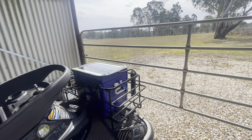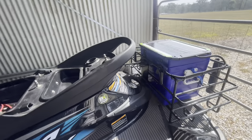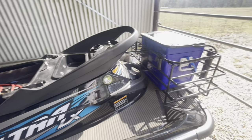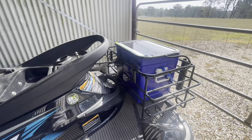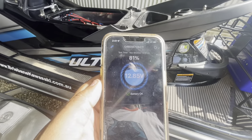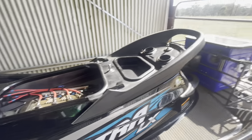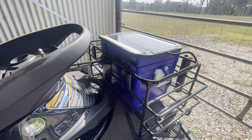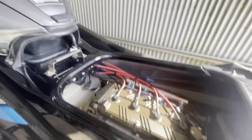So that's it guys — a fairly simple, easy way to keep your battery from running out. You can use the same principle on a boat, caravan, jet ski, or whatever. This is on my Kawasaki 2019 Ultra LX non-supercharged jet ski. I'm sure there are other ways to pass the wiring and other panels you could use, but this panel seems sufficient and it's doing the job. It's up to 12.85 volts now. You could just leave it connected indefinitely, or when you're going out you can disconnect it — the ski charges the battery when running anyway. When you come back home, just connect them again. You should be able to put the seats back on and close the compartments.